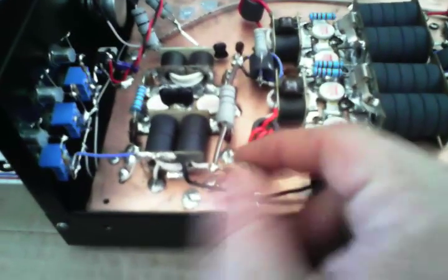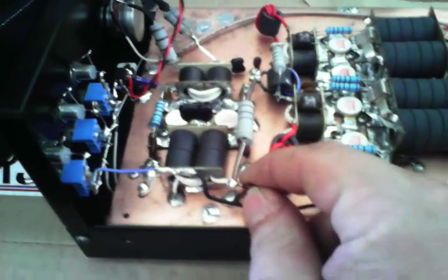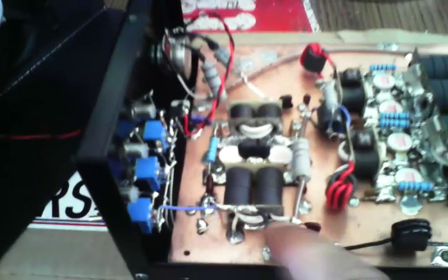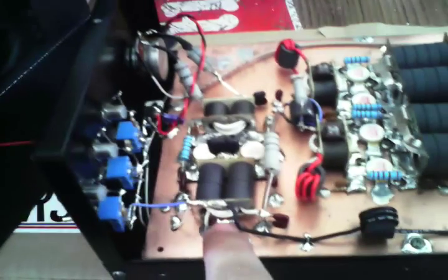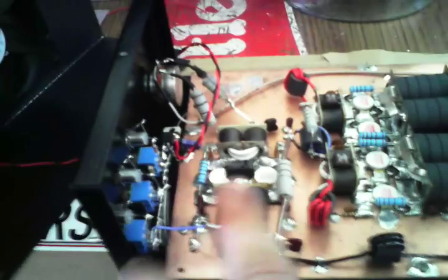So after I saw that, I went ahead and tested all the other solder points, man, and checked them out. I went ahead and re-soldered that for you, of course. Also, this transformer right here was kind of a little low to the board. Whenever I see something like that, I'll take a little piece of copper and just kind of wedge it up under it and solder it so that board will never short out on that board right there. It's just needing positive DC voltage there.